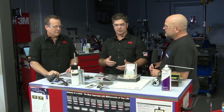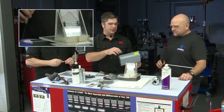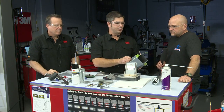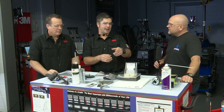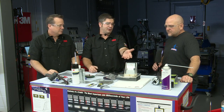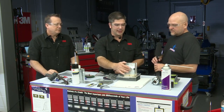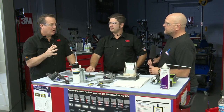We've talked about this using the cavity wax wands in there, but how is it getting in between these flange areas where we've welded, or these MIG welds where it might not be perfectly flat on the backside? That capillary action is what's taking place. We've been here for just about 60 minutes now, and it's gone that far up a 5-inch coupon, basically defied gravity. That's pretty incredible. And it's wet, and it's not on the outside. It's actually in between the two panels. So something to think about.